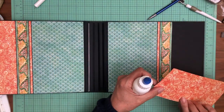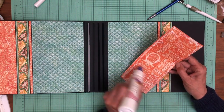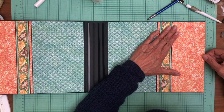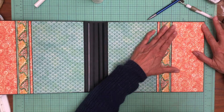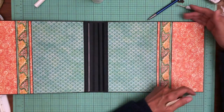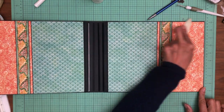I deliberately leave this stuff in because I spend a lot of time figuring these things out on my own. What I've noticed is most people that do tutorials don't talk about these kinds of things. And if you are like me and your eyes are drawn to the edge, those lines that aren't straight drive me crazy - I'll spend more time looking at a crooked installation than the paper itself. And we know it was crooked to start with and that looks pretty darn good, doesn't it? So again, the key is never to keep trimming off the top and bottom - it's to start coming in at an angle until you've clocked it back around. It doesn't always work out this well, but this looks pretty good.